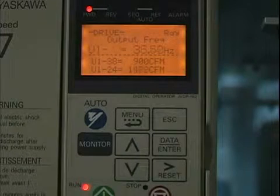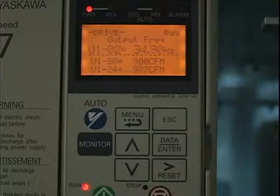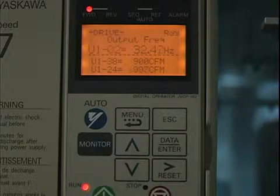So we've got decent regulation going now. I'll adjust the damper, which causes the drive to run slower. We might cycle in and below 35 Hz first, but if it's not five seconds, the drive won't go to sleep. But it should stabilize somewhere below 35 Hz, which will put us into a sleep condition.